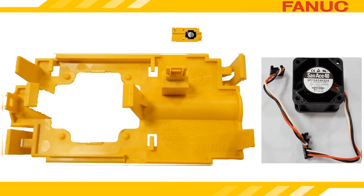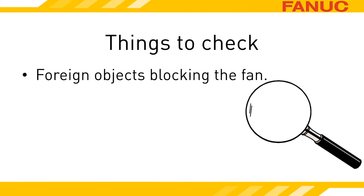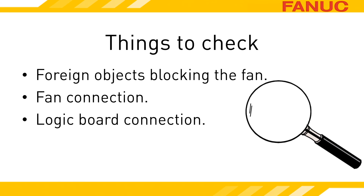The yellow plastic housing can be reused unless it's physically damaged. Molded into the plastic you will find its part number, likely beginning with A230. Now that you have the fan out, there are a few things you can check for. Is the fan physically blocked or filthy? Cleaning it up may fix it. Try to reseat the fan module — perhaps it was a bad connection. Is the plastic that holds the fan connector in place broken? Is it possible the fan isn't plugging into the amplifier correctly? The gray board that has all the connectors plugging into it is removable from the amplifier — try to reseat it. If all of that fails, replace the fan.